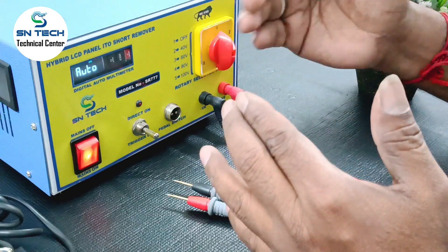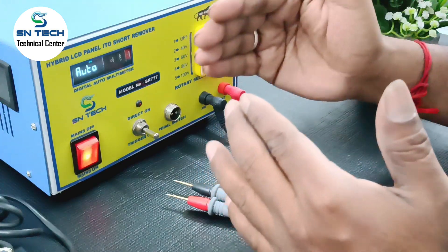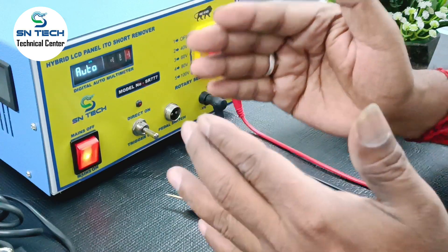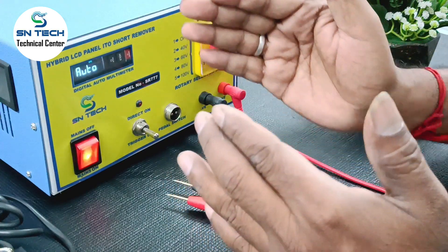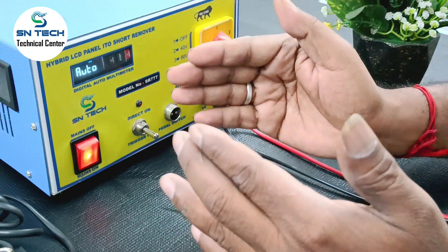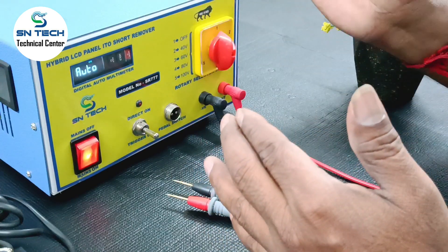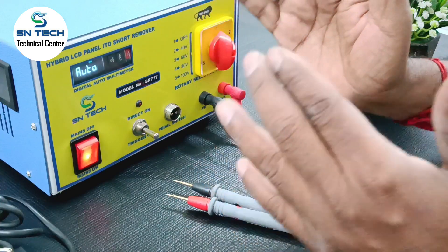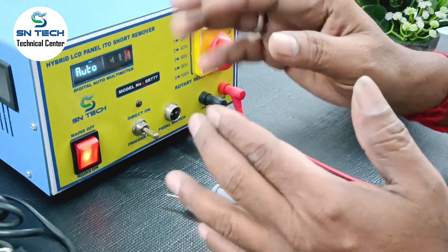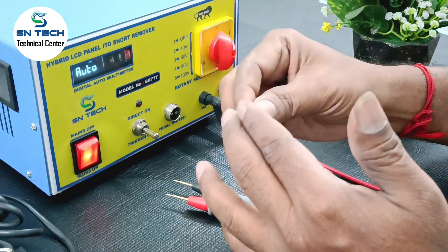But once the short is created, or some carbon forms, then initially it will be from megaohms — maybe 50 mega, then 45 mega, 40, 30, like that. Up to 20 megaohms the TV or our scalar would not get muted. Below 10 mega it comes — maybe there is a chance to go to muted. In kiloohms, definitely it will go to mute mode. So the short starts with megaohms, then kiloohms, then ohms. If ohms come — dead shorter. It will never get to on; it will not deliver the VGH, VGL voltages.